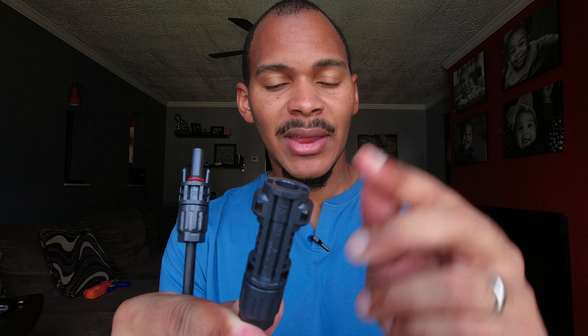So let's get to this flaw. I'm kind of bugged out by this because it's not the biggest deal, but most people new to solar won't have what they need to actually deal with it. You can see the normal MC4 connector, but on this one there are these little holes that guard you from being able to disconnect the panel. If you bought this and didn't know — I didn't know. I plugged it up and when I went to disconnect it after hearing Jason Noyd's advice to try a device with a better MPPT controller, I noticed I couldn't get to it. Luckily I have the Renogy tool and could disconnect it. But like, why would they do this? If you don't have those tools, it's pretty much impossible — I don't even think you could get needle nose pliers in there. Jason Noyd, if you're watching, does yours look like this or did I get a weird version of it?